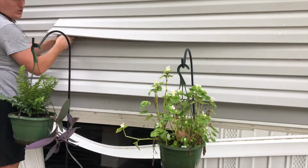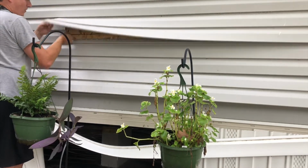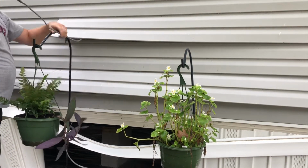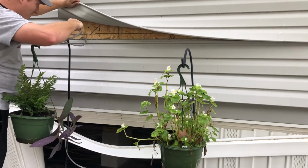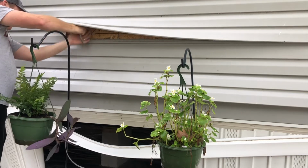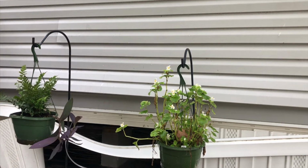And it's really important to use the outdoor wiring, because there's indoor and outdoor. The dark color, the gray color, is for outdoor. It's made so it can get wet, it's waterproof. And so I'm gonna shove through about 3 foot. That way I just make sure I have plenty on the other side. Just shove it in the hole. Just like that.